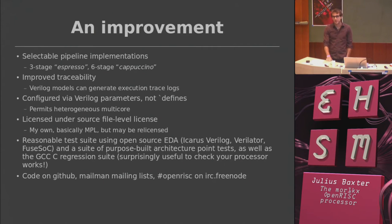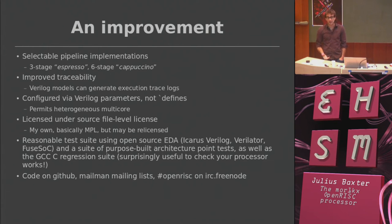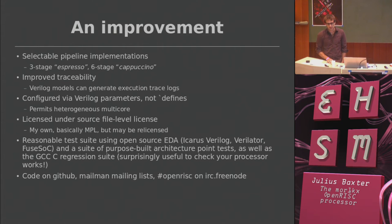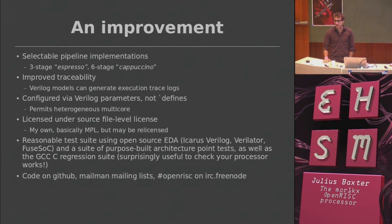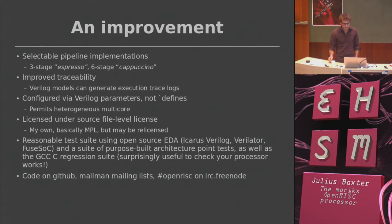There's a pretty good test suite to verify functionality and prove to anybody who downloads it that it actually works. If you do digital design and write IP cores for a living, you'll understand that proving the thing works generally takes more time than writing it. Looking at a typical code base, the design is about 30% of source lines of code, and verification and testing is the other 70%. It's a big deal, and I don't think it's done properly enough in open source hardware projects.